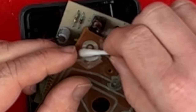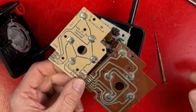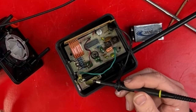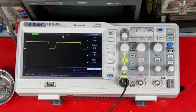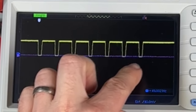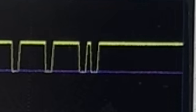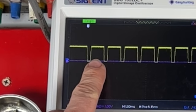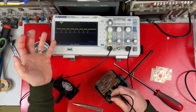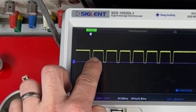Here's the circuit board out of a regular Atari controller. You can see it's very similar — I actually expected this board to be identical, but I guess Synex made their own. There's one more thing I'd like to try: seeing if the signal from this is visible on my oscilloscope. It took me way too long to get this to work, and this is the signal straight off the aerial. These dips here are probably what we saw on the TV as white lines, and each button closes up one of these gaps. There's an extra gap at the beginning which doesn't seem to be affected by anything — I think that's probably just so the receiver knows there's a signal coming.